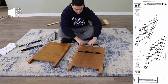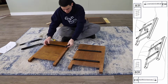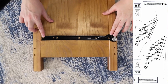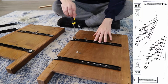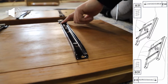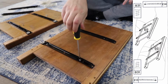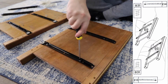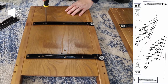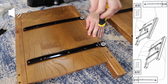When aligning the side panel glides, remember the wheel goes towards the front and bottom of the piece. Double check that the screws are driven down until they are flush with the glide to avoid potential drawer snags. If you are confused about the glides, please watch our assembly detail video highlighting the glides. You can find the link below this video in the description.